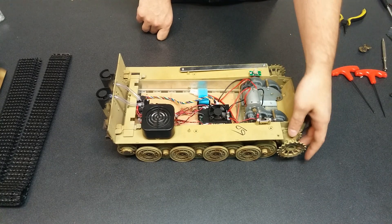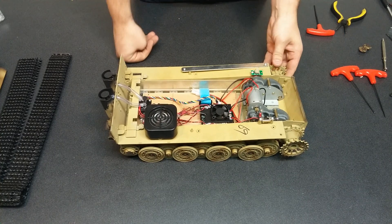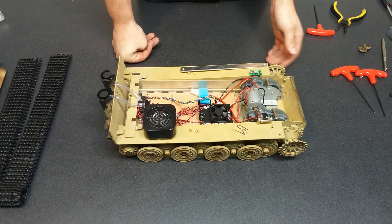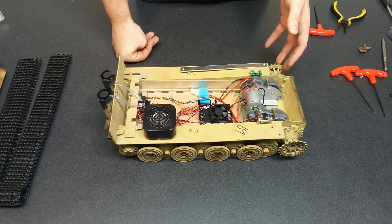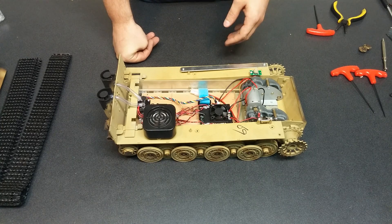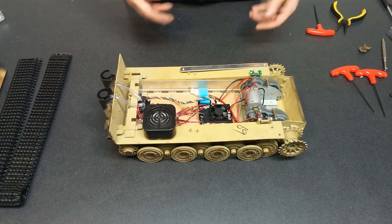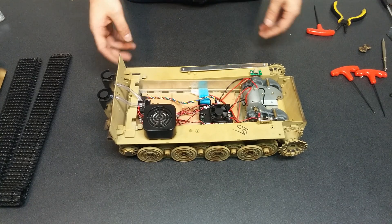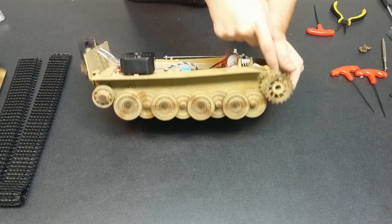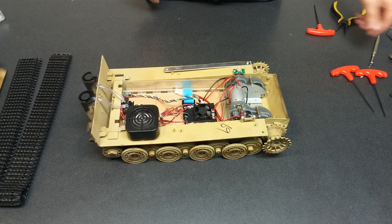Next what we're going to do is replace these drive wheels. We're going to go ahead and pull these guys off. They will probably be stuck. I will show you guys an easy way to get off the drive wheels from the shaft. Our shafts are a little bigger than some of the other cheaper ones around, so it's a little bit better fit, which is sometimes a little pain in the butt to remove, but I'll show you a trick to do that. I've also already went ahead and removed the caps for the drive wheels — just go ahead and use a flat head screwdriver to get that off.